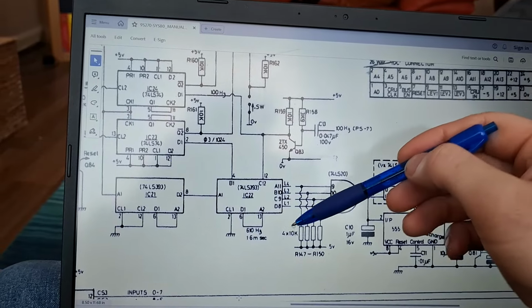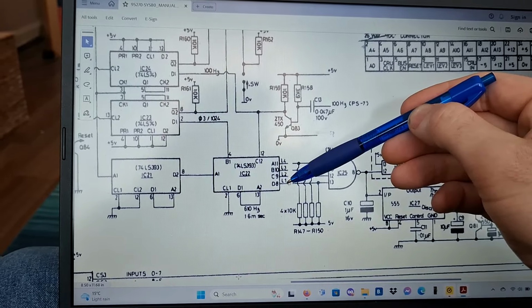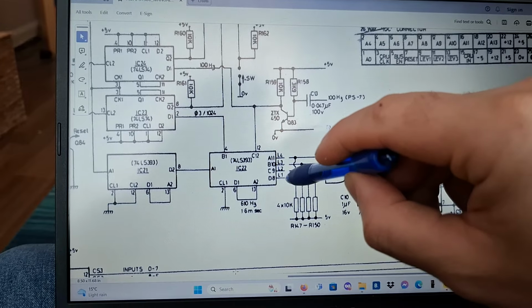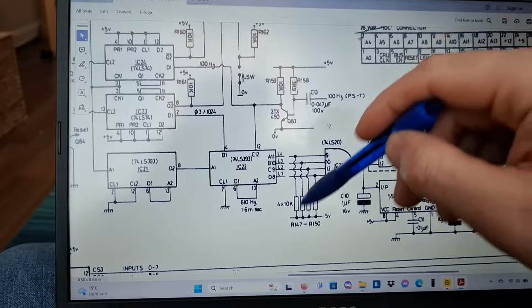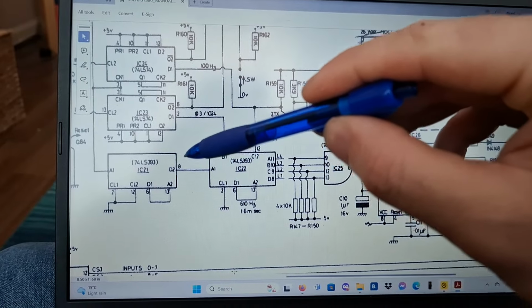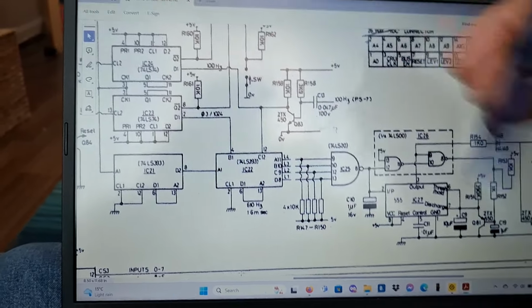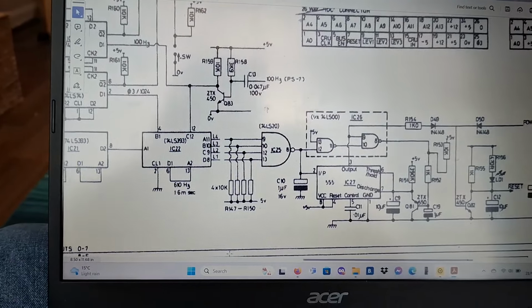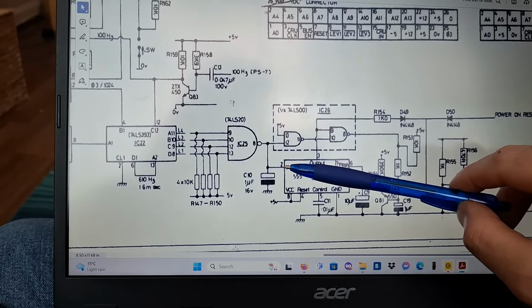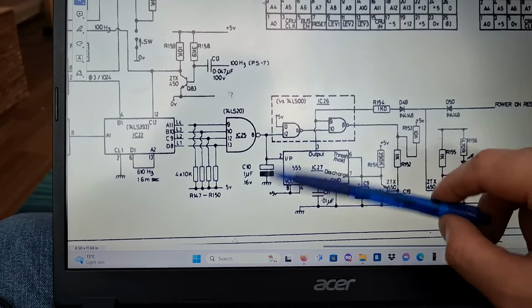So every time this can count up. Yeah. So when it's counting away, this link, it's looking for this link to be low, which keeps this high. These are just there to make sure they stay high when they're not called for. So if this can count up faster and this can reset it, it determines the missing pulse isn't there. Okay? What then happens? This drops low. Doesn't drop low straight away. Briefly charges that capacitor and this drops low. Okay?